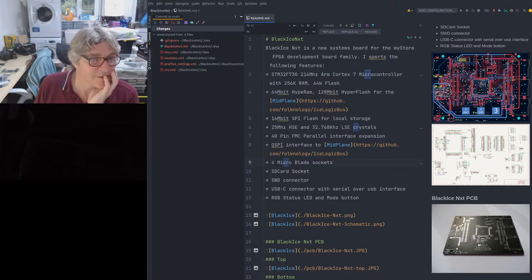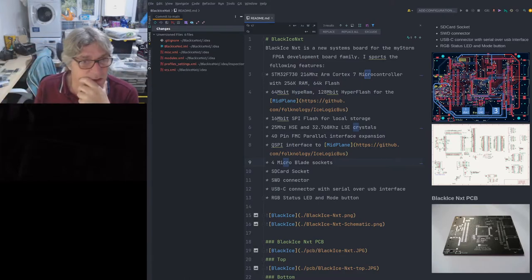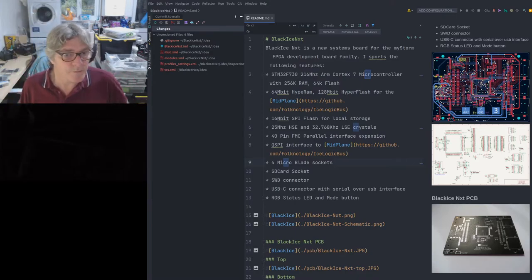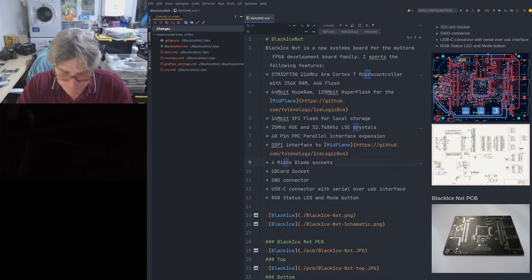It was related to the SD RAM, I was saying. Syncing flash reading and SD RAM writing is a bit tricky. Well, I guess so. When you're saying the flash, is that SPI flash attached to the ECP5? Or is it ESP32 flash that you're talking about? Yeah, SPI flash. I presume you mean tricky by timing or interleaving.